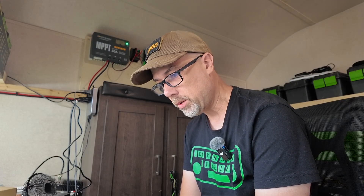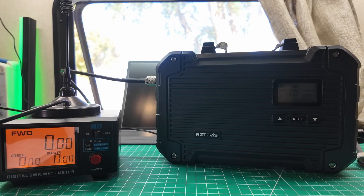So we're on channel 1. Channel 1 is 462.550 for transmit, 467.550 for receive. Power is high, bandwidth is wide, and the sub-audio is 136.5 Hz. So we got to get a GMRS radio and set it up for that. The repeater's face says transmit and receive — you have to switch that around in your radio. I knew that, but I didn't know that. I need to talk on the receive and receive on the talk frequency, but I thought the talk and receive were set up properly on the display to be what I needed to put in my radio. They're not — they're the opposite. Now you know. So this is 15 volts input power, and we're going to key up on a handheld through the repeater and read the repeater's power level on its output.